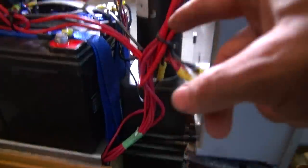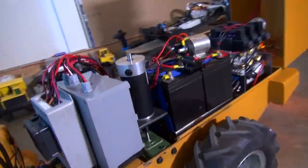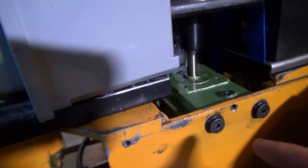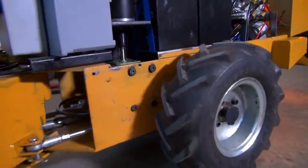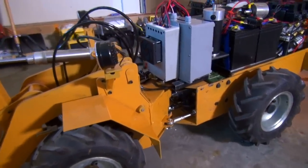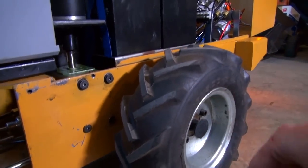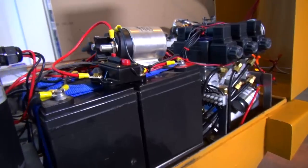I've had to pull this apart. This is a motor on top — it goes into this gearbox. I took this whole gearbox apart and it's actually a screw drive on the inside, with a 60-to-1 gear ratio in there. Some folks say the tires look kind of small for it. I agree, but at the same time I also have to think about the size of the drive shafts, the power distribution, and changing the gears if we make the tires any bigger.